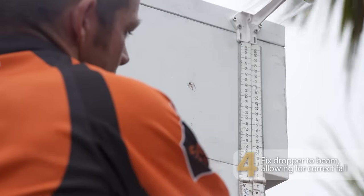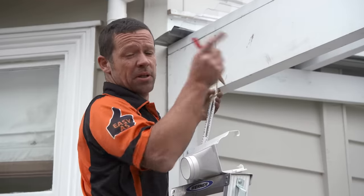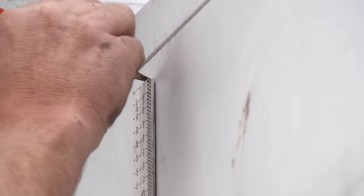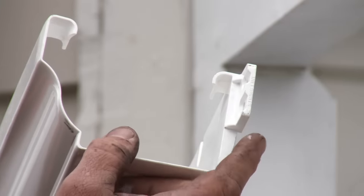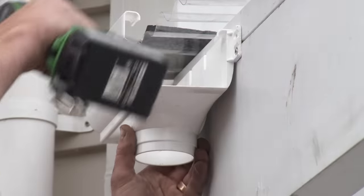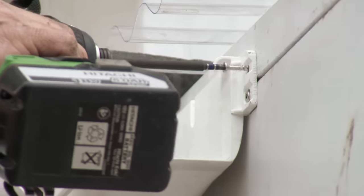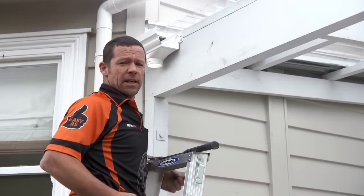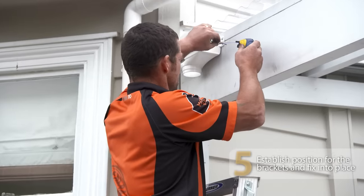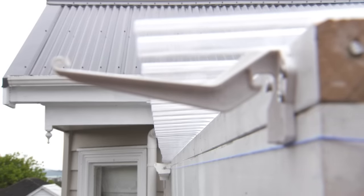I'm 223 millimeters to the bottom of my bracket. So on this side I'm going to make it 220 mils — that's going to give me 3 mils of fall over 5 meters. This line must line up with the bottom of our dropper, or expansion outlet. The next thing I have to do is run a chalk line from the bottom of that bracket to the bottom of our other bracket down the other end. I'm going to use the chalk line to mark on our beam the exact location of the bottom of all our brackets.